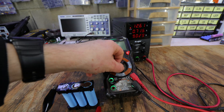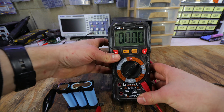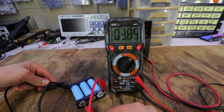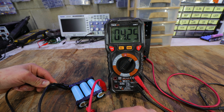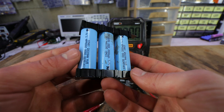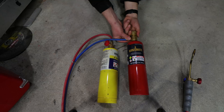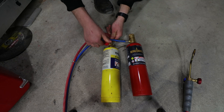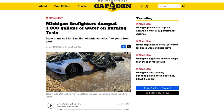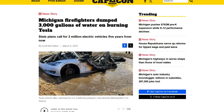Once the battery pack is fully charged, we can go ahead and measure the cell's voltage. The first cell seems to be at 4 volts, while the rest are at 4.25 volts. Now even though we can argue that this voltage is still safe, over time the cell voltage will shift higher and higher until it will eventually start heating up and go into thermal runaway, which is a state where the battery starts producing its own heat, oxygen, and fuel. And it's why the fire department has such a hard time extinguishing fires from electric vehicles.